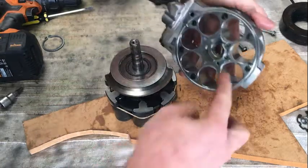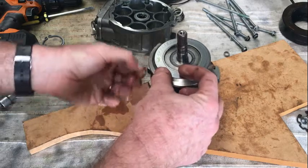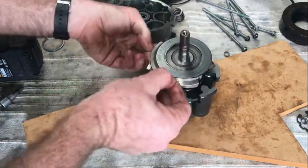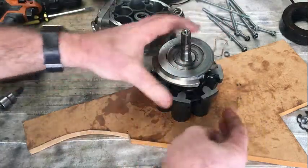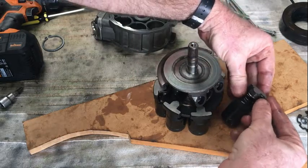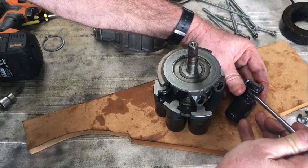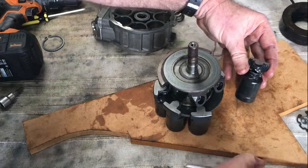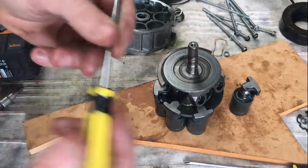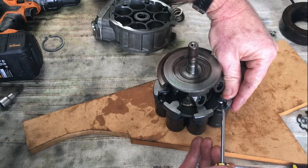There's the casing — you can check all the bores in here. My advice is to do this one by one. If you pull a whole lot off, getting it all back together again is a bit of a bugger — it's definitely doable but it takes effort. If you pull one piston off, you can see there are these little half-moon pieces that sit on either side. They are the things that ride on either side of the swash plate to allow the piston to go up and down. Getting these back in takes a bit of effort — just hold them on a nice flat surface and push them into place.